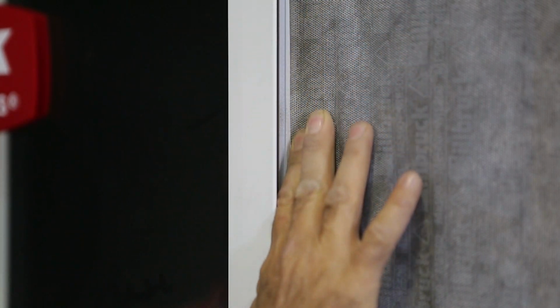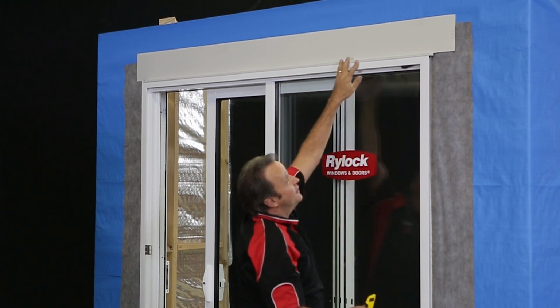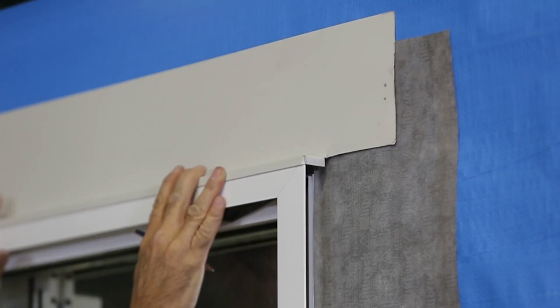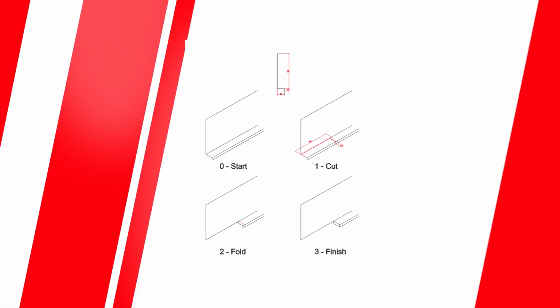Where the top of the door is not protected by the eaves, it is necessary to fit a head flashing. Head flashing should be fixed to the wall frame above the door and cover the head. Usually this is either a pressed metal Z flashing or Alcor. This one I had pressed up and cut and folded the ends using this detail.